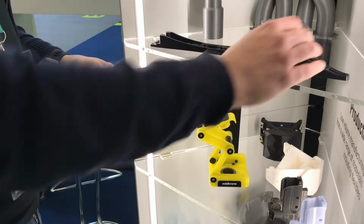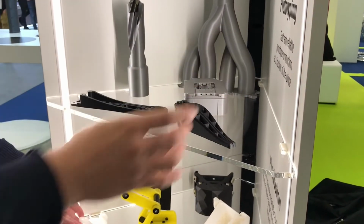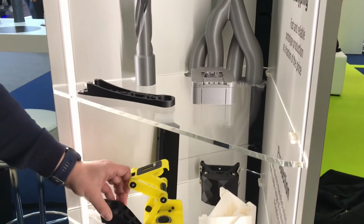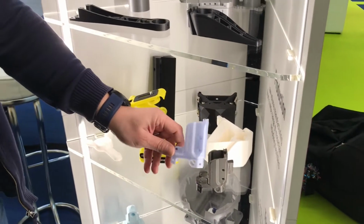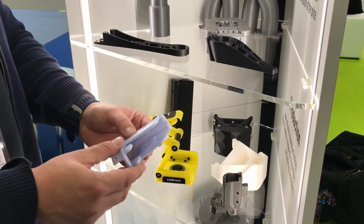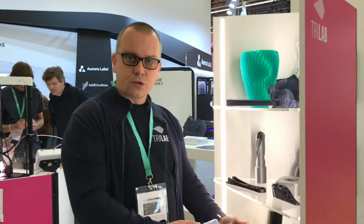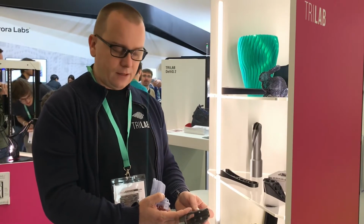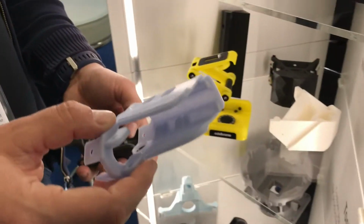And then we don't end up, you know, we continue through nylon, and this is, by the way, the nylon with carbon fiber, so it's functional. It's not only a prototype, but also a functional piece. And we end up with a very cool solution, which I especially like. This is wax filament and printing the wax positives for the upcoming casting. Wow. So casting, this is if you need to do some prototype from full metal, and you don't have to do the negative form for the wax positives. You simply print the wax positives.